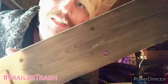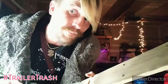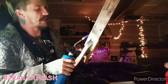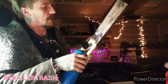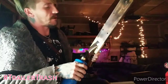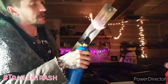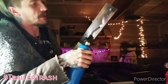This is also a really good way of waterproofing and fireproofing your home - a quick tip for you guys. Most people do this where they just do a quick pass over it and burn the soft wood, and they don't bother to do the second pass and burn that hard wood, which is actually a longer lasting form of doing this Shou Sugi Ban.